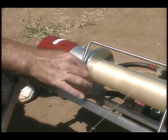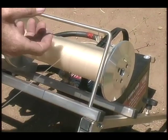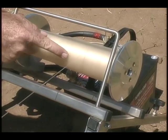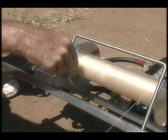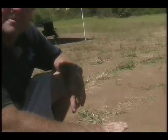The drum is machined. You're able to take this end plate off and slip on different diameter Delrin sleeves to change the actual diameter of the core of the drum. That is used to adjust line speed and torque from the winch, because the motor has a maximum set power.